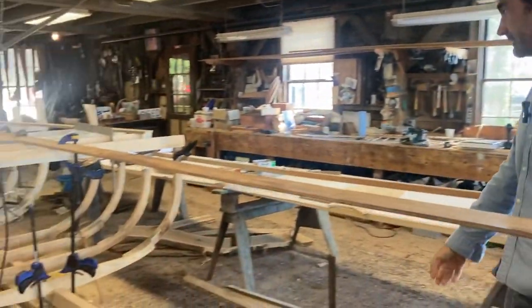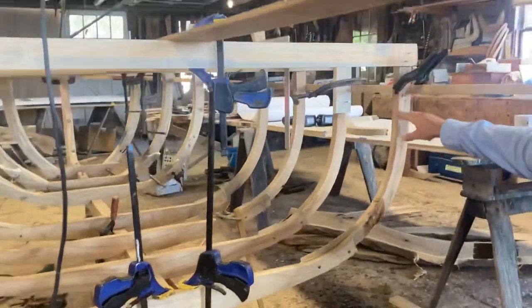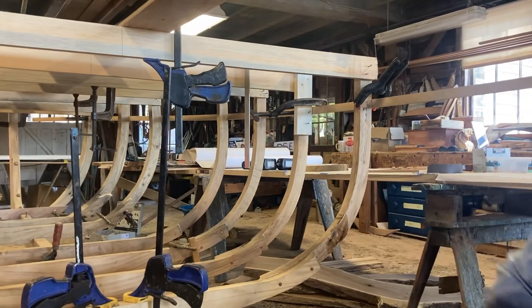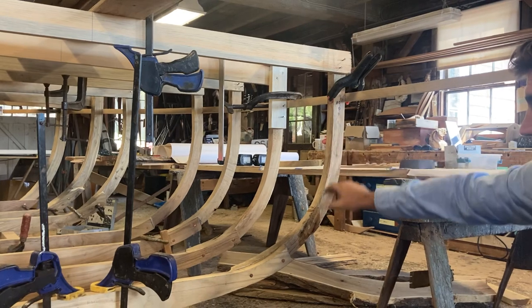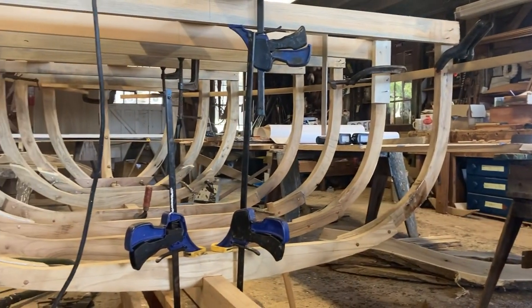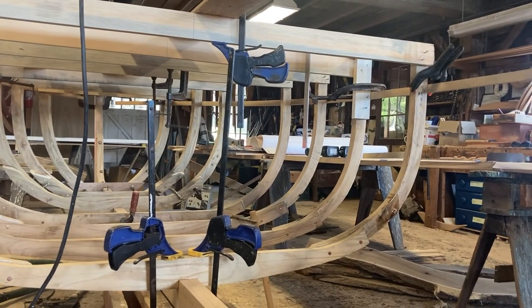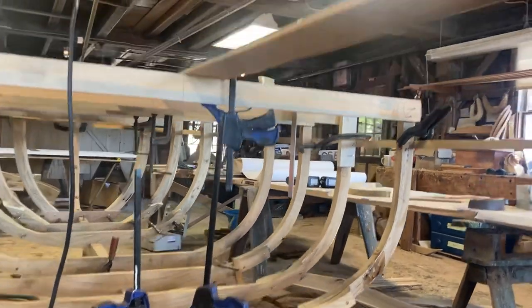If you look at the frame itself, the hard thing to find is a piece that is grown and actually follows this shape right here. The frames are made up in three pieces — what I would call a top frame or an upper futtock, top futtock, and then a floor timber. The floor timbers are relatively straight; it's more this upper piece that has to make that turn in a pretty short radius. So if you've got any of those, or think you might, get in touch and we'll come cut them up and put them in a boat.